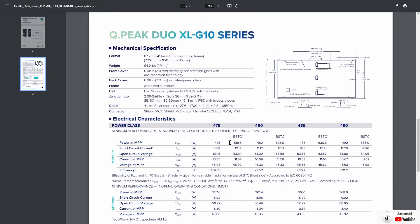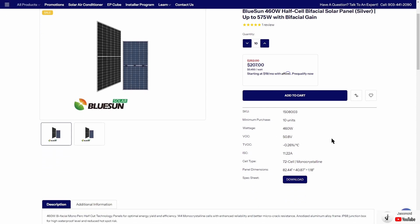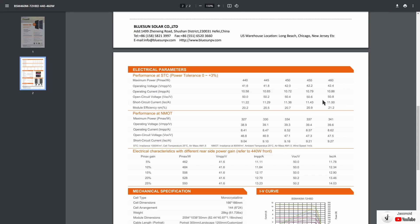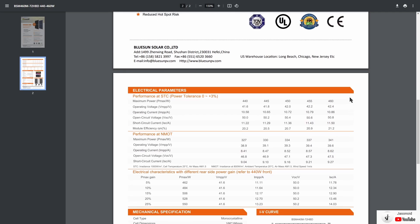The next solar panel that will work well on the F3800 is this BlueSun 460 watt bifacial solar panel. These are a little bit cheaper at $207 each, and they have a VOC a little bit lower at 50.8 volts. Looking at the spec sheet, the voltage at max power is 42.4 volts. If we put these in parallel in a set of three, we can max out the 25 amp input limit and get a little bit over 1,050 watts. A little bit less voltage means a little bit less power, but these panels are more affordable, so you'll have to do a trade-off.